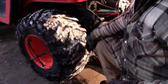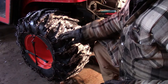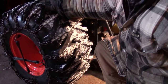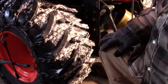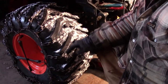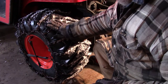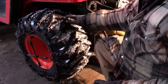I have my tractor jacked up, and these are the chains that I had on it. When I was explaining earlier about these cross links going down between the bars — if you look right along there, for over halfway around the tire, the only part of the chain that's sticking out — there's a couple links right there and a couple links right there — that's the only chain that's above the bar. So it really doesn't give a whole pile of traction. When I had my other tires on, they were R4 Industrial, so the bars were a lot wider and flatter, closer to the crown of the tire. So those cross links went across a couple of bars and they did stay proud of the tread of the tire, but not with these tires.